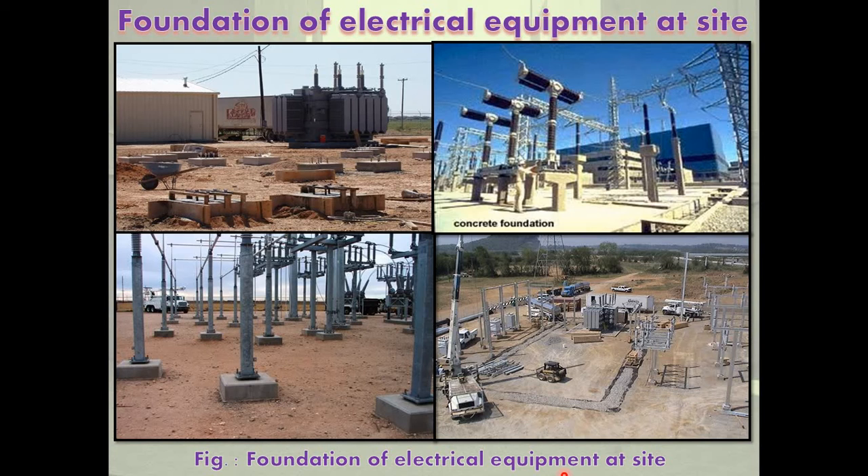First is place of use of machines: the height of the foundation depends upon the type of soil on which the machine has to be installed. If the floor is hard, the height of the foundation can be reduced. Circuit breakers are installed in open land, so the foundation is decided after studying features like weather, whether the soil is soft or rocky.